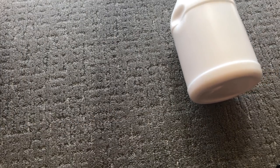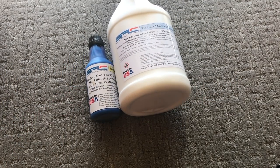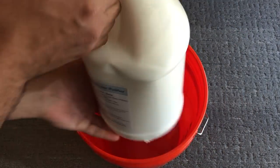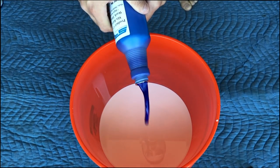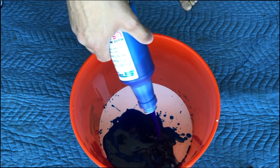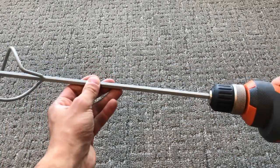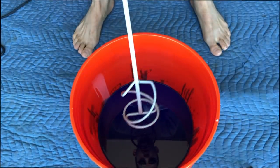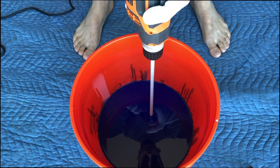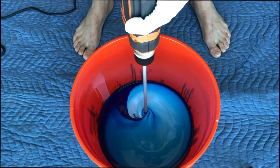The process starts with a two-part RTV silicone which takes the exact shape of whatever object it touches. We pour the white silicone into a bucket that we got from Home Depot and then we add the blue hardener as well. Next we buy this concrete mixer from Home Depot for just three dollars and we attach it to our drill. Mix your RTV silicone very well. Note that you only have about 15 minutes before it begins to harden so keep track of time or it might all harden prematurely.